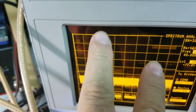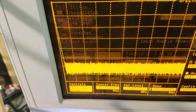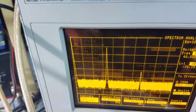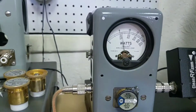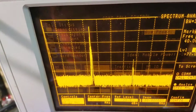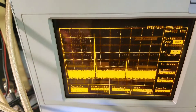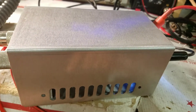Those are the only two spikes you're going to see pop up. If there was anything else popping up, then we've got a radio that's dirty feeding this amplifier with something that shouldn't be there. So I'm keying it — and there you go. You've got your 27205 and your 54,410. We're keying it with about 24 watts dead key. We're modulating 100 watts. This amplifier is clean — what you're putting in it is what you're going to be getting out of it.